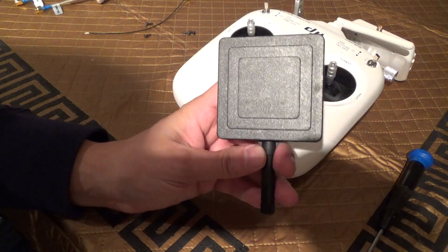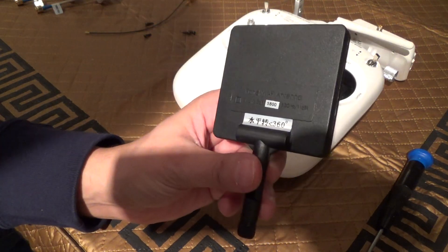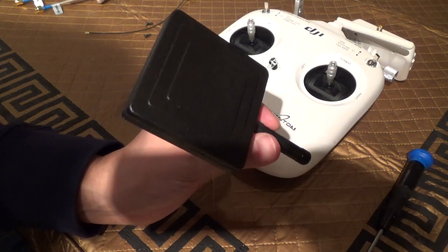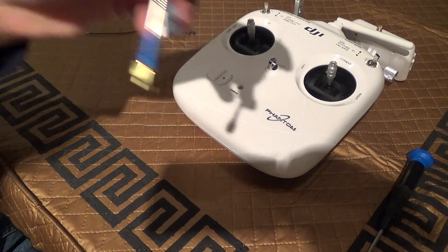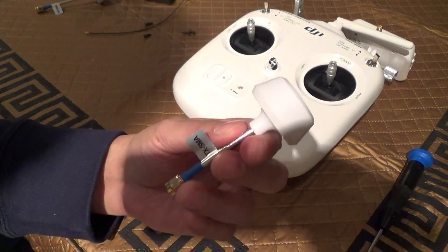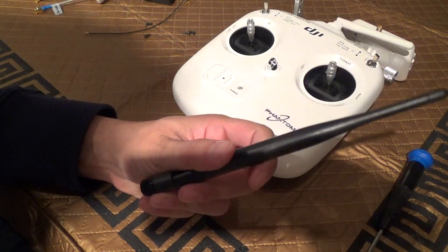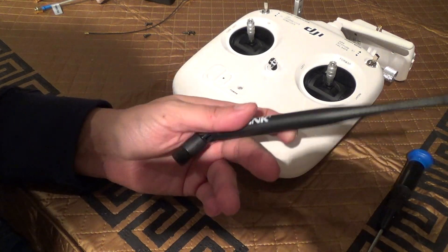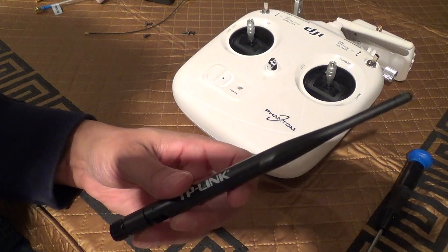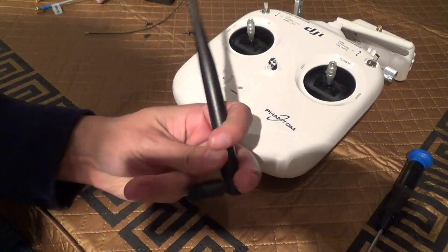Let me show you some antenna options you can use. This is a dual band antenna — it will work with 2.4 and 5.8 GHz, with 11 dBi gain on 5.8 GHz and 8 dBi gain on 2.4. This is a directional, so you'd really need to be pointing in the direction of the Phantom — not ideal for all scenarios. You also have a Cloverleaf antenna; this is a 5.8 GHz Cloverleaf, although this particular one is fairly small so it may not give much more gain than the standard antenna. You should also be able to use any 2.4 GHz antenna, since there's no separate wire diagram — it's just a plain whip with wire. I'm probably going to use the TP-Link 5 dBi, or maybe a couple of 6 dBi antennas.